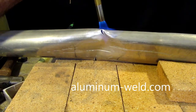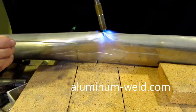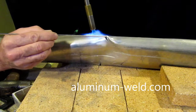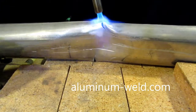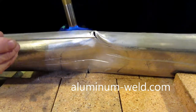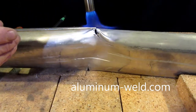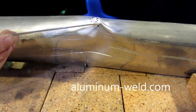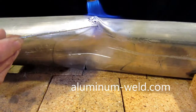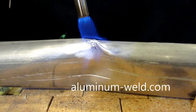I'm going to turn the torch up and heat this up and make this repair. The rod has just been melted by the heated aluminum — see that? The rod has been melted by the aluminum. Now that I've got up the temperature, all I've got to do is maintain that and then I can make that repair, just like so. It is important you go past the area of repair by about three-eighths of an inch or so. That ties the aluminum together and you get maximum strength that way.